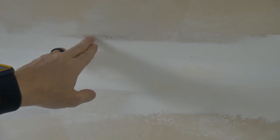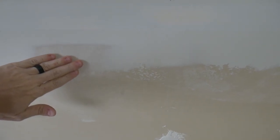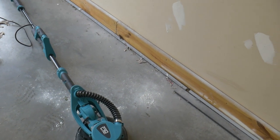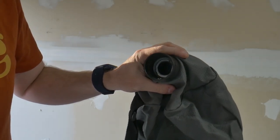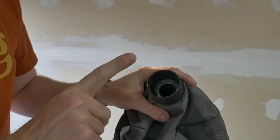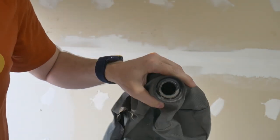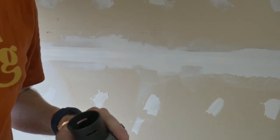As you can see, it's really easy to go a little too far with the sanding, so you have to be very careful. But it does sand very flat. It does produce a little bit more dust than I would like, especially when you're letting off the throttle and the blower stops running. So I'm going to go ahead and hook it up to my shop vac and hopefully it'll do a better job. Just to take note — that little bit of sanding I did, the dust made it all the way down the handle, through that hose, and into the dust collection bag. So it does work as designed, I just think a more powerful option could make it a little more effective.